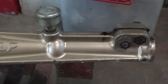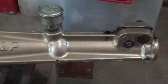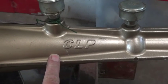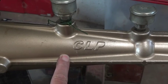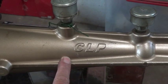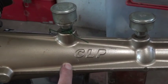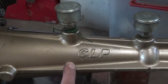That way, there's a give there — nothing gets broken or snapped off. Right about in here is a bearing. This does not have to be a tapered bearing; it's just a ball bearing. There's no real heavy load on it because you've got that keyway — the keyway takes the load off it. So it's not a heavy thrust load, it's a rotating load, which means you just need a high-speed roller bearing.